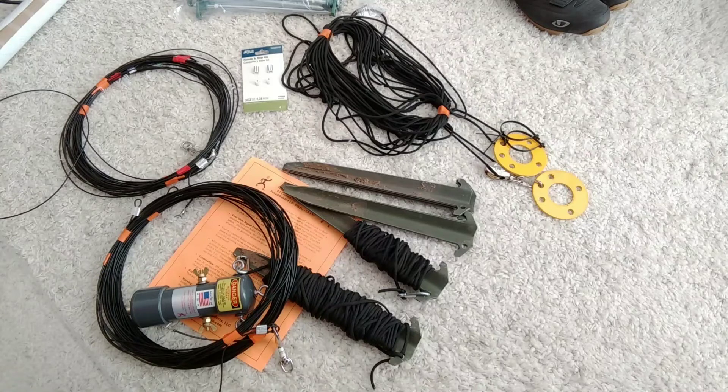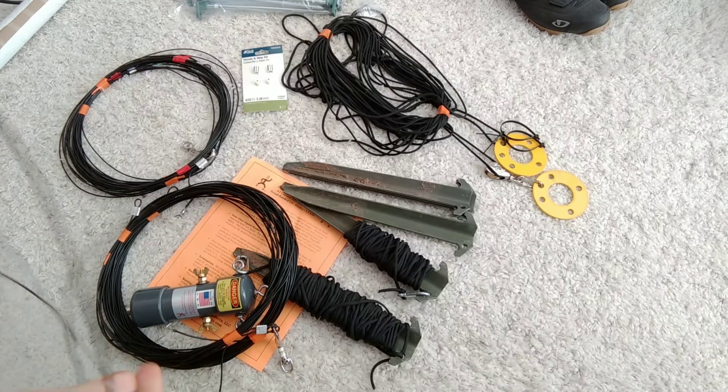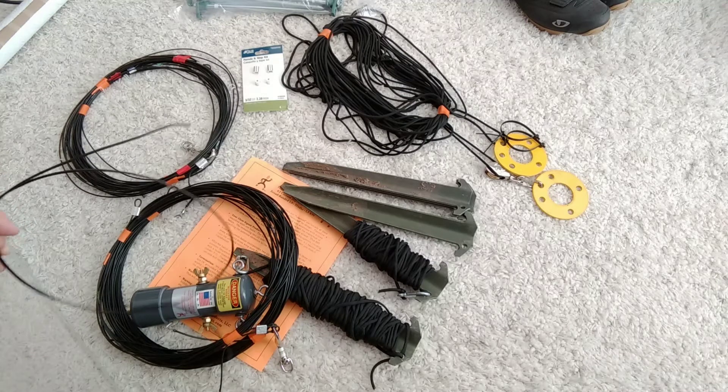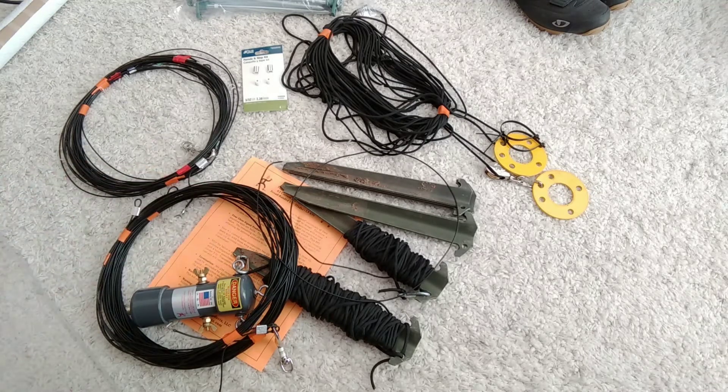Let me show you the antenna. Here's the wire that I use — this is Wireman's 532 wire, about 136 feet of it. It's very good. It's steel core with a copper clad, also called copper weld wire, and it's one of the best things you can use for dipoles, especially since RF uses the skin effect. The steel core doesn't cause any resistance to the RF, and the copper cladding is what's used by the RF for the current.